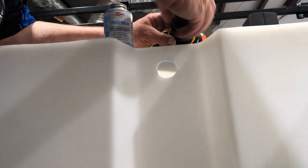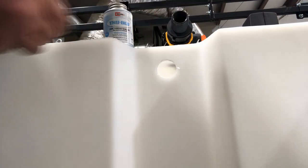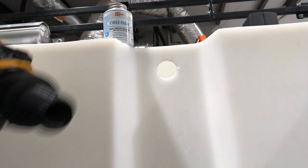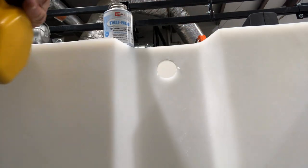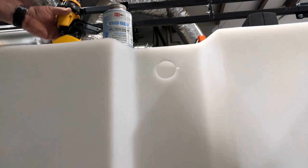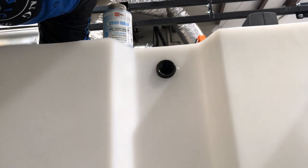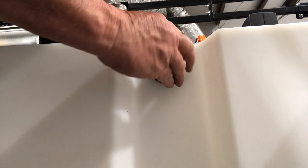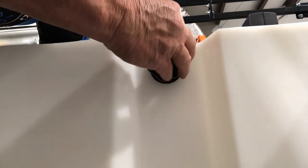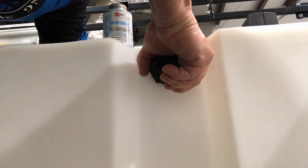I've already drilled my hole. I'm going to take the lock nut, spinning nut, and small gasket off the bulkhead fitting of the float valve because those two parts go on the outside of the hole. I get the float valve down and out into the hole, then I put the little washer over it and spin the nut on — it's reverse thread for tightening, and it tells you on top which direction. I hand-tighten it really well to seal it up and make sure it's straight inside.